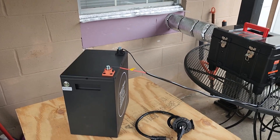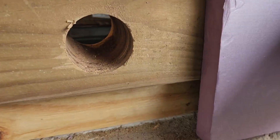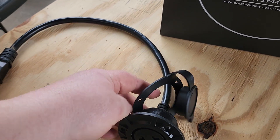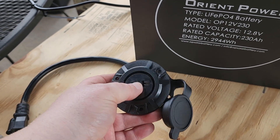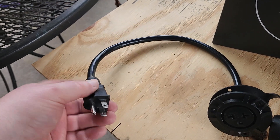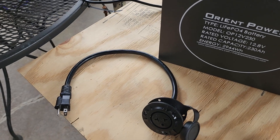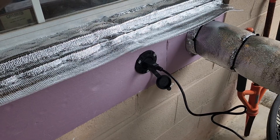I'm going to go ahead and start by drilling a two-inch hole in this piece over here. It was pretty thick — I had to drill through several layers with the hole saw. It does have a little rubber gasket that fits in behind the outlet, and when the outlet's not in use there's a little cap that goes over the front to protect it and keep water out. This is a 12-gauge cable, it's grounded, and it has a special plug. It's rated 15-amp but it's really good quality — only about $15–16 on Amazon. I'll put a link in the description.